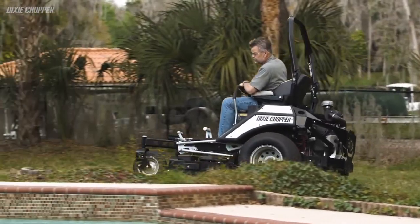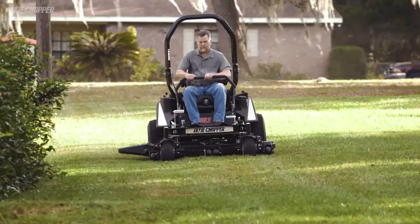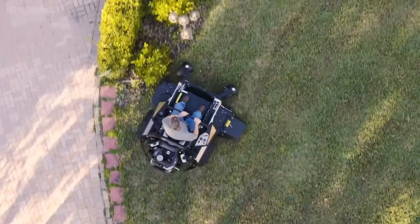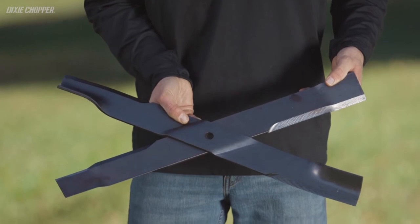Both of these mowers use our industry-leading X-Blade. This extremely robust blade is unique for a few reasons. First is the durability — the X-Blade has the highest Rockwell hardness of any blade in the industry to last longer, especially in areas with heavy sand and rocks that can dull other blades more quickly. Second, the X-Blade is a super high-lift blade with a tall kicker, and this extra lift generated by the blade lifts the grass up higher for a clean and even cut. Another feature is the extremely long cutting edge — most blades in the industry have a much shorter cutting edge, so the X-Blade cuts more grass in each rotation. And lastly, the channel in the middle of the blade allows the customer to add a twist blade for a mulching effect.